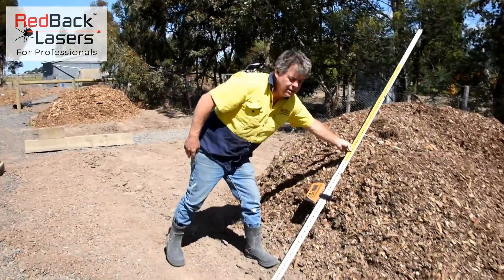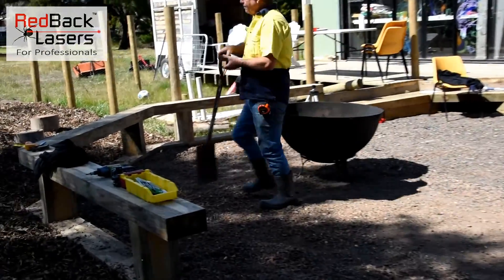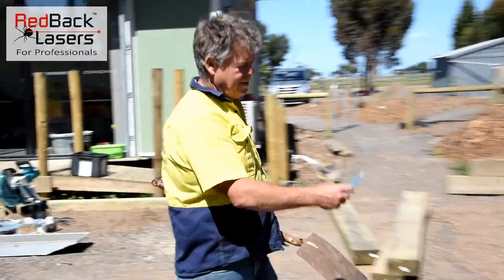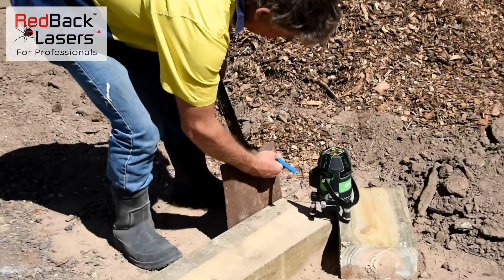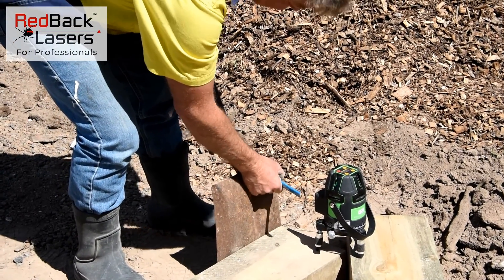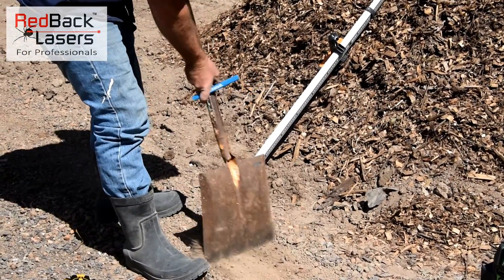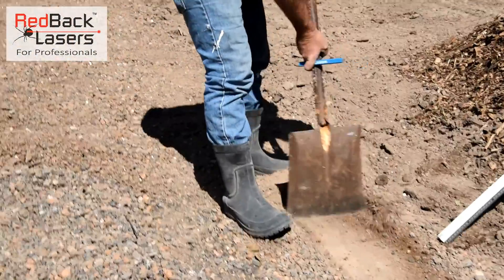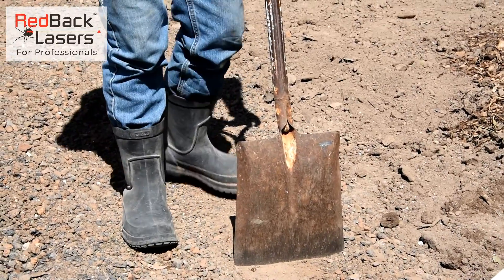To make it a little bit easier, I'm going to go and grab my shovel and a pencil. What I'm going to do is put a mark on my shovel that's level and I want to go below that — so I want to go to there. I can just come along and level off, so I know I'm getting the width of my sleeper at the right level.